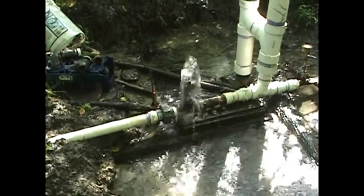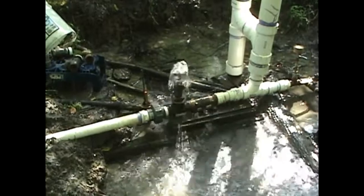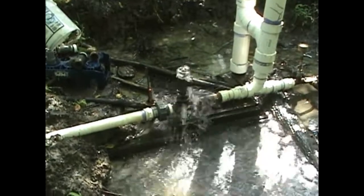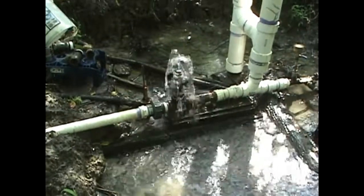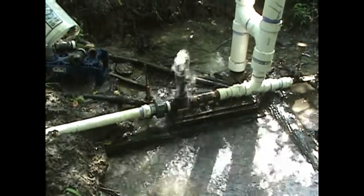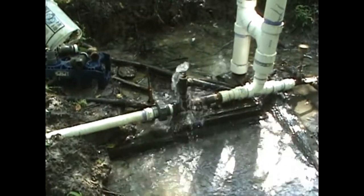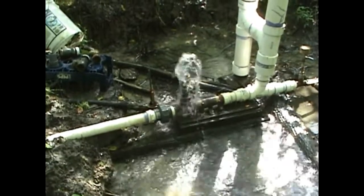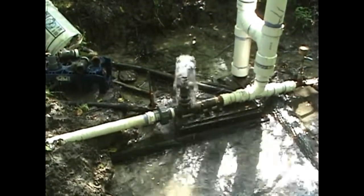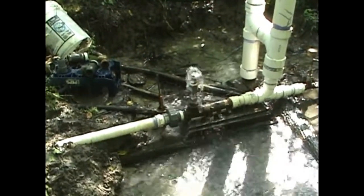Now, it won't build as much pressure or pump as high, but if you've designed your ram pump well and your parameters are right, you'll still be okay. This ram pump with the inch-and-a-half check valve on it will produce up to 90 PSI, which is good for over 200 vertical feet. I don't really remember my pressure test results, but I would guess it would produce 40 or 50 PSI with the smaller valve, which is still plenty to overcome the 72 vertical feet I'm climbing — I only need 31 PSI to equal that, with a little more to overdo it.